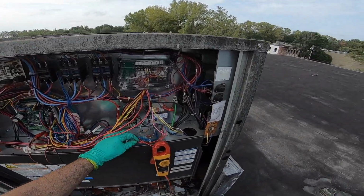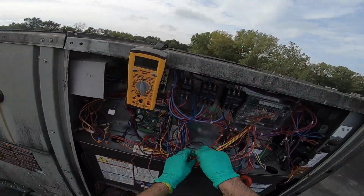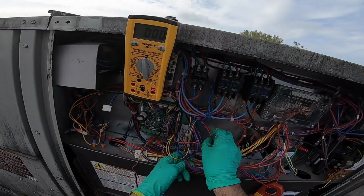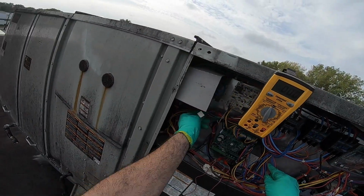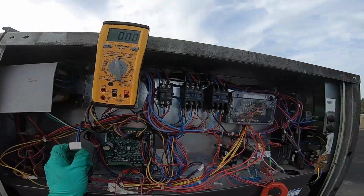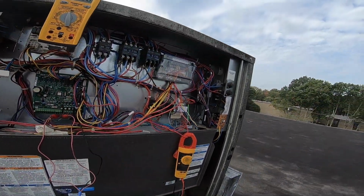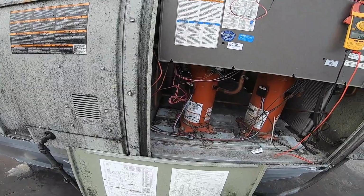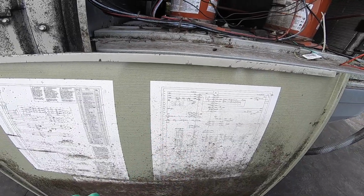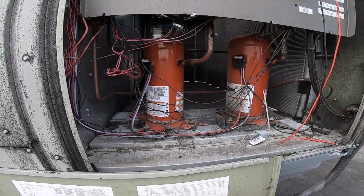This fat guy, does he have a number? Because he's probably an add-on. Where's he going? Let's follow him and go for a ride. He's going to the back. Probably feeding power for the economizer. Surprised we don't got a number as we're chasing him. Oh, we do, 31E. So we have a number to chase him out on. So 31E is going to, okay, TCO1, high limit cutout. So that's heat.